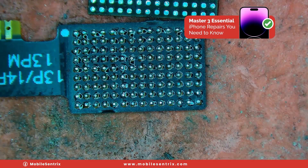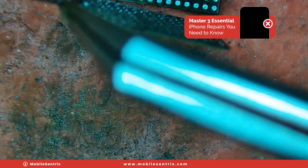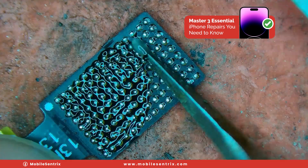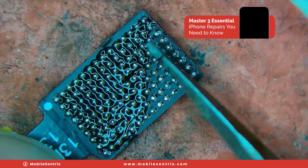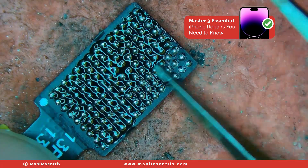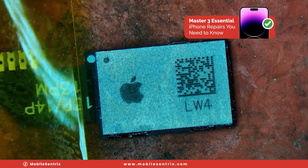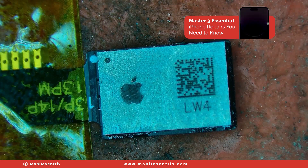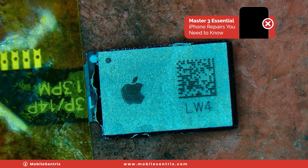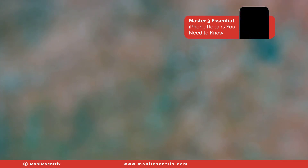As you can see, the tag-on flex is pre-balled — we've got all those nice little bits of solder on there. We'll add some flux and carefully spread it around, making sure we have a nice even, really thin coating. We'll line up the dot with the dot in the corner, take a bit of Kapton tape so the flex won't move on us, and solder it on and let it cool down.